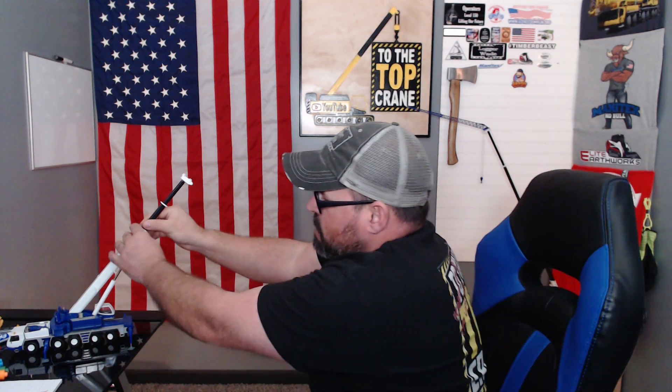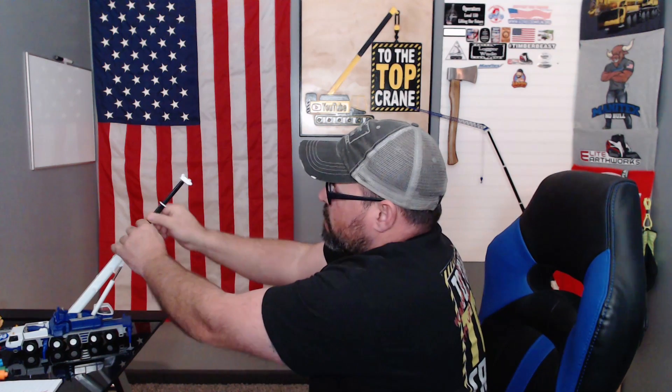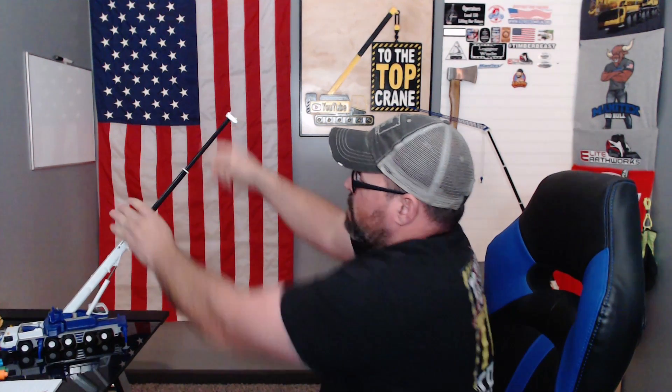It's actually a little less than 50%, but that would give me 71.9 feet of boom length as well. However, it has less capacity at the radius I need to pull my counterweights off, which is 41.8 feet. The reason why it has less capacity is this section is bigger. As you reach out further, that extra weight has more of an influence on the load chart, and that works progressively as you work through the stack. So if I have this one at 50%, this one at 50%, and run my third one at 50%, that puts me around 100 feet — I actually have less capacity at that radius because I've got another heavier section involved.